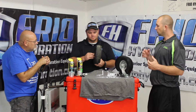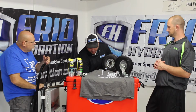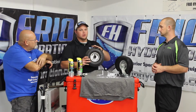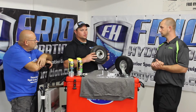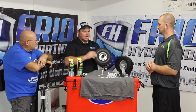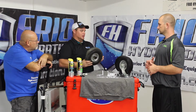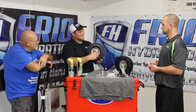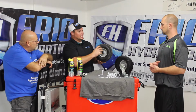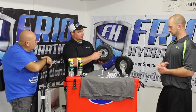All right, so you also recommended marine grease. Why is that? Correct. Marine grease is actually the grease that goes in hubs on your boat trailers or on your fittings on boats, wherever that would be. The thing about marine grease is it has a little bit higher water displacement. That's what you want. You want to get the water out of there. It's a thicker grease, so it sticks quite a bit. It has a little more tack to it. It's going to stick, hold there, keep the water from getting in to those places you don't want that water in.